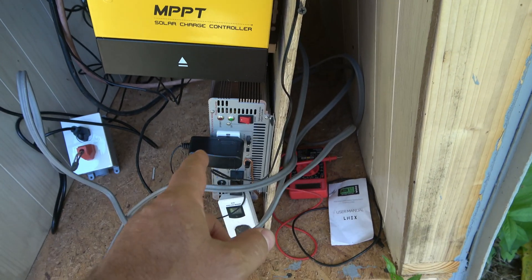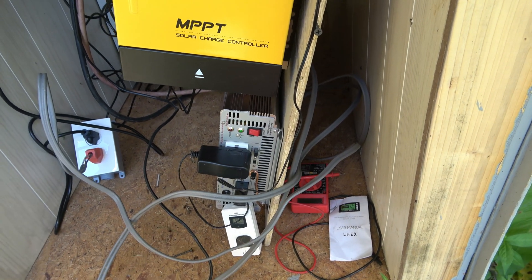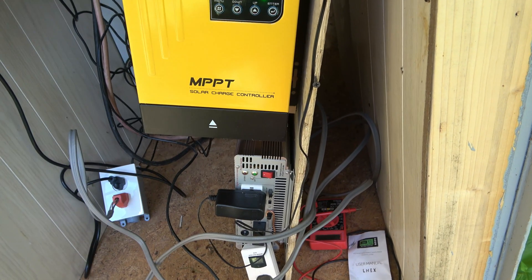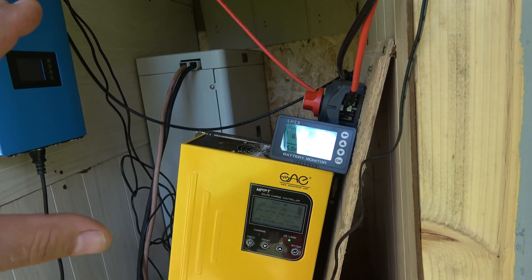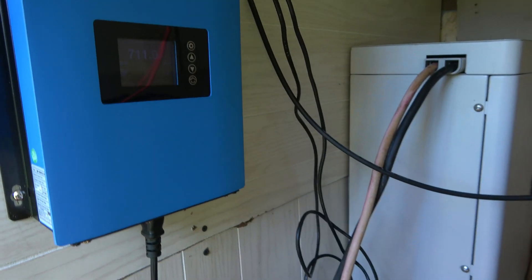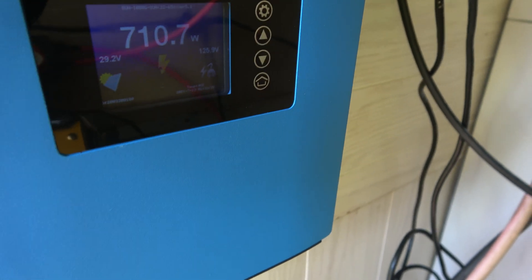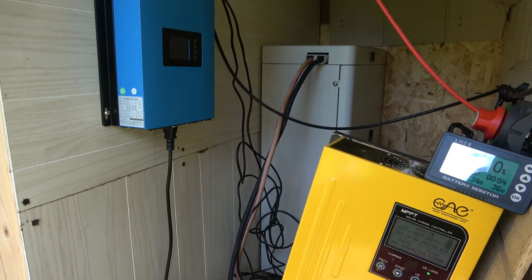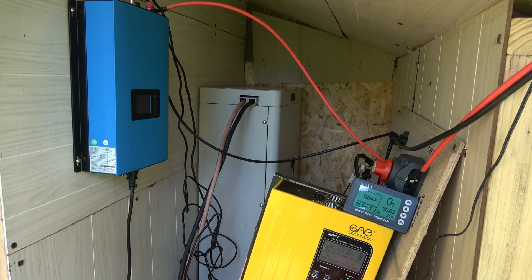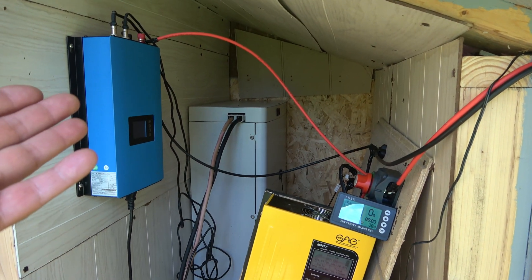The reason is I'm using hardly anything. I've got the Ames power pack here, the 3000 watt inverter, but I'm just running some security cameras and small stuff with it — I'm not powering any of my house with it right now. That's why, even though these are both powered up, nothing is coming into it — it shows no wattage, so you might think it's broken, but it's not. All the power is going into the grid tie, and that's that right there. You can see right now, partial sun, 710 watts going into the house. So it is back-feeding into everything — the water heater, the air conditioning, clocks, microwaves, VCRs, TV sets, anything that has a parasitic draw. Currently, this is helping to offset the cost of that.